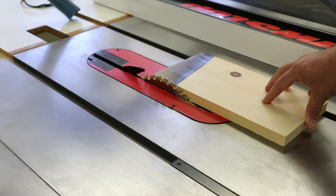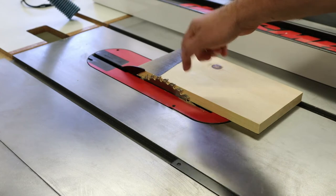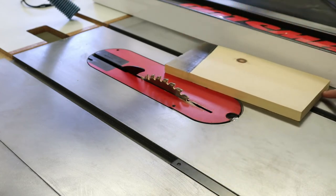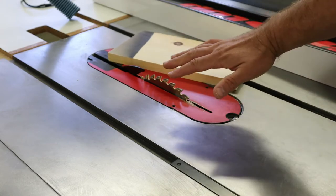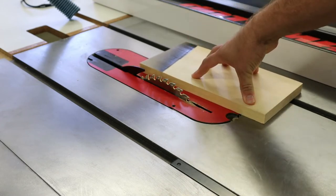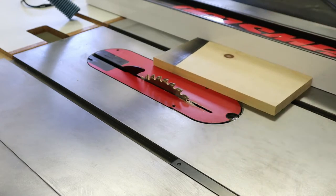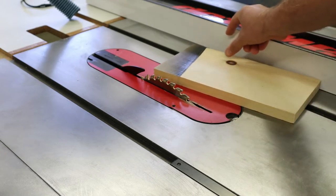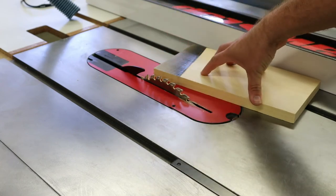As we push this thing past the blade, it's going to continue to cut at the front of the blade, pushing that board down into the table. But as we push forward, the board tends to slide towards the blade — in other words, it's pushing into the blade. If the board is allowed to move away from the fence, if it is not held rigid up against this fence, you're going to get a problem and it's going to probably result in kickback. If it comes away from the fence, you're looking at a dangerous situation that's likely to result in kickback.